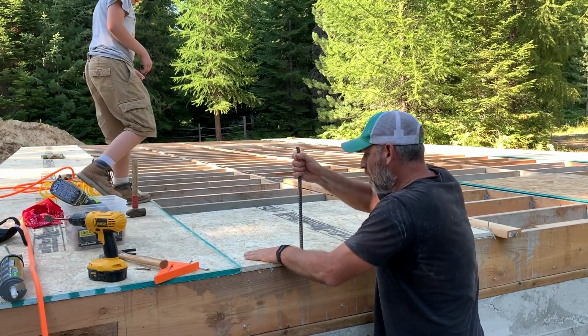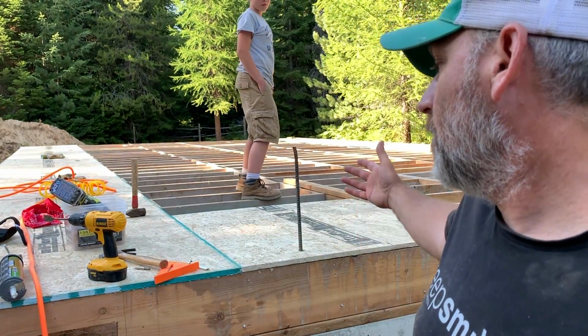Nice. I know that some OSB requires a 1/8 inch space on all four sides, but watching the manufacturer's installation video, you only put the 1/8 inch space where you use 10-penny nails or 6-penny nails, only on the 4-foot side, the non-tongue and groove side. And so that's what we're doing. We're following their instructions. Hopefully it turns out okay. It's time to nail and screw.